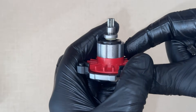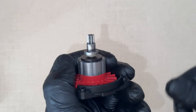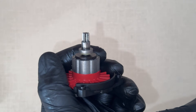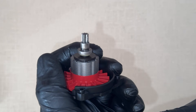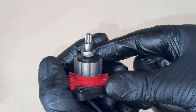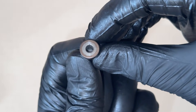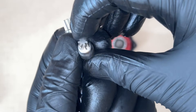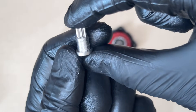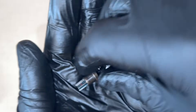Another thing on these — just like the C3 that came before them, this drive gear here has broken on a couple of them. The conversion does nothing to increase the chances of that, and in all fairness, I've seen it on non-converted ones more than on converted ones. This is somewhat easy to fix if you've got a metal lathe at hand. They break just around where they've been pressed into the shaft. You'll need to get one of these and, using a lathe, convert it into the correct shape. It fits spot on and does the job perfectly. Link down in the video description.